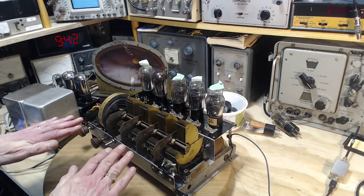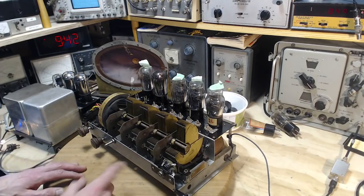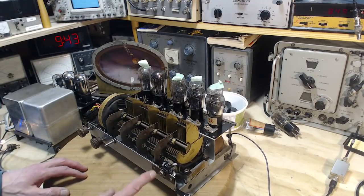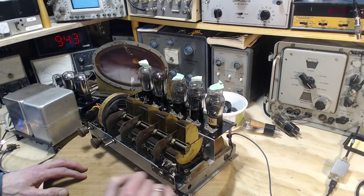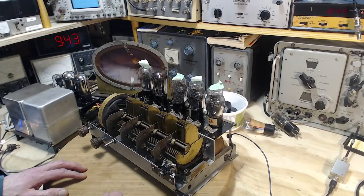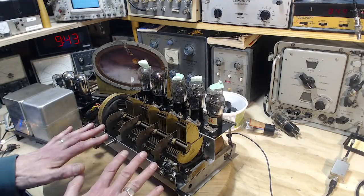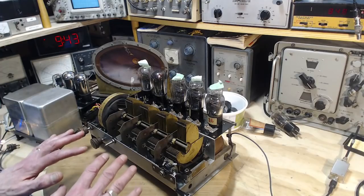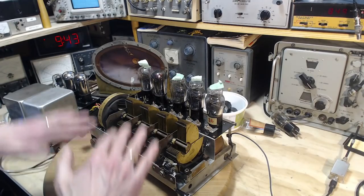Oh, let me just pop down. Got quieter and quieter. Could be everything from a little bit of dirt in the volume control here. So things like that, where the radio's operating level just suddenly drops a bit for reasons unknown at this point. There, just did it again. That's the kind of thing that will cause havoc when you try to align a radio. While you're trying your best to do it, and the radio itself is jumping up and down, the signal you're using is jumping up and down, you're going to get nowhere.